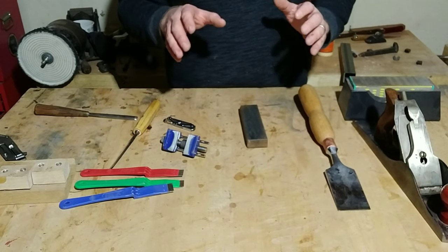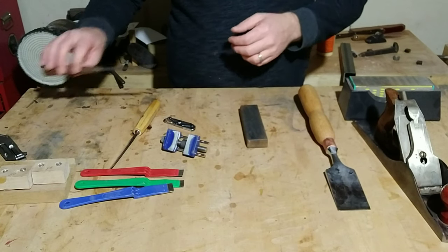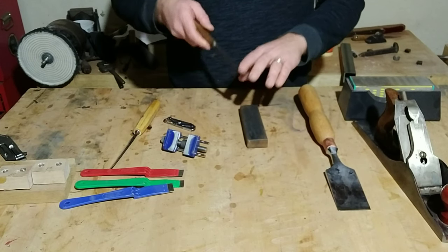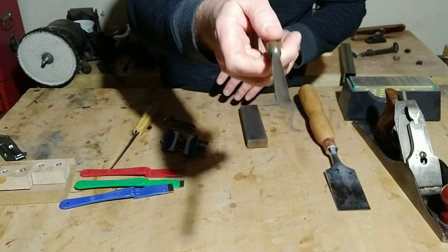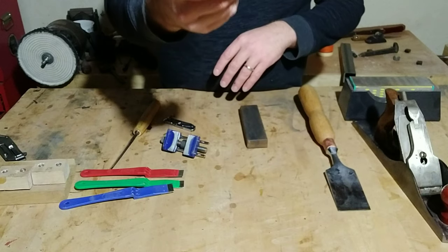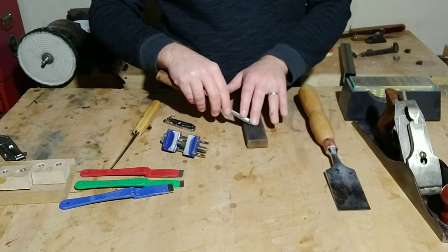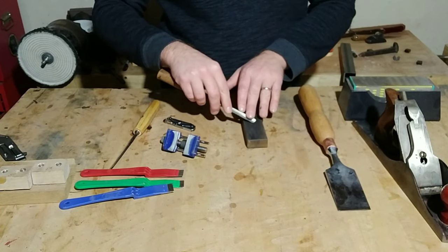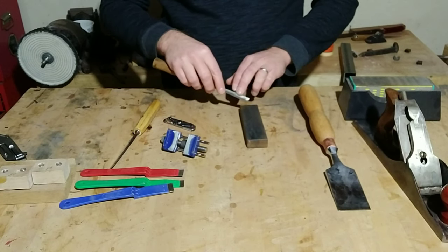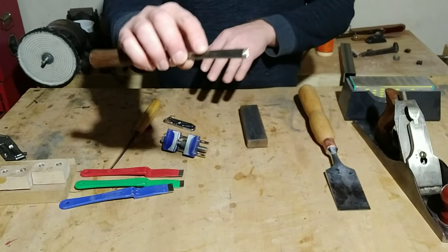The last tool is a little tricky, and I'll admit I'm not the greatest at it — I get a good enough edge to work with but still need more practice. That's your gouges. It's a curved surface, which makes it harder to sharpen. Basically what I do is roll it along the angle across the stone, and there's no really good guide I've come across for this, but you can roll it across to get that angle established on the gouge.